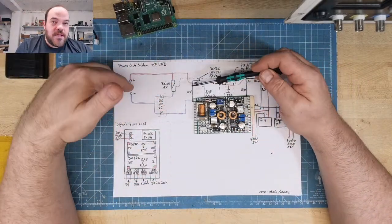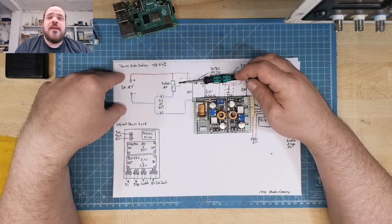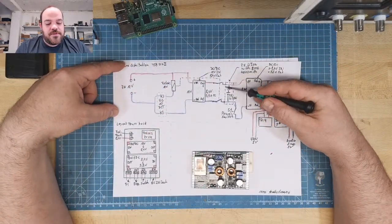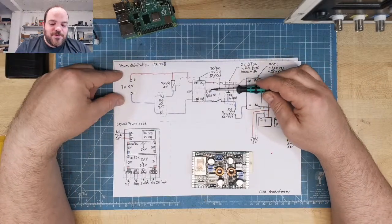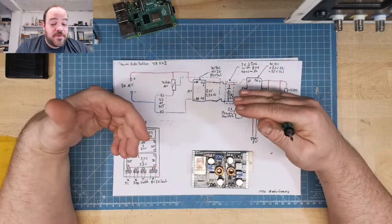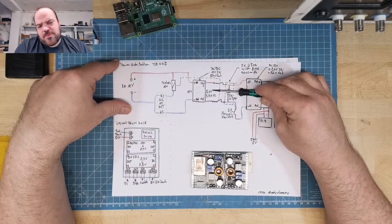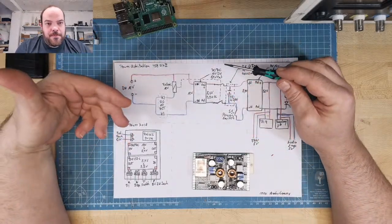So, just a relay. The relay was connected like, okay, you plug in the 12 volt from DC, and it just closes the path to the battery. Here's the battery. But then I realized when I unplug, the relay doesn't fall off, it doesn't switch off, because the back voltage, or the voltage that comes back from the module, from the output to the input, was high enough, and the current also, that the relay stays on.